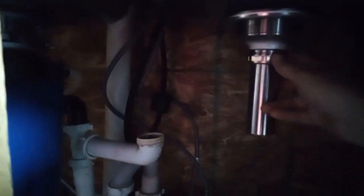I had to take a hacksaw to the other pipe that was too long to get it to fit my new garbage disposal. And then I rotated this back proper because this other hose was a bit short, and I didn't realize I had set aside a bag that had a whole other hose in it. But I need a new thingamabobber, clearly, because this is not gonna work out. It costs a little bit extra money to get one of these with a tailpipe on it, but then it's going to be able to fit into another tube. The way it is now, this little dinky thing would have to plug into the old one all the way up here, and it wouldn't stay on, and the threads are messed up on the old one, so I keep leaking, and I got damage down in here.